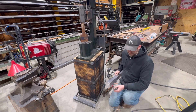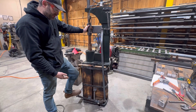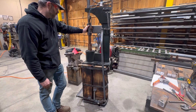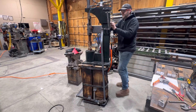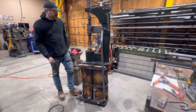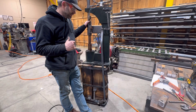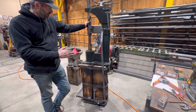I'm pretty happy in the sense that the spring on the treadle feels just about right as far as tension goes — that was a guesstimate based on our Champion mechanical hammer. The valve is actuating the amount we need it to. Let's put some air to it real quick and test it fully with the treadle hooked up. And that's just awesome. I'm testing it with a little tiny compressor here in the shop, but I'm going to call this hammer done other than a few minor things on the air system.